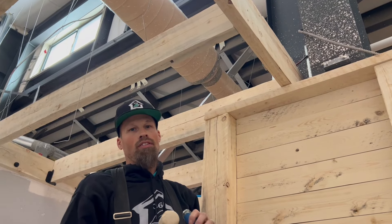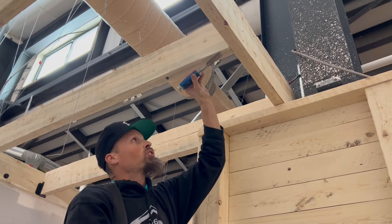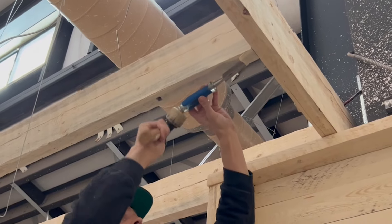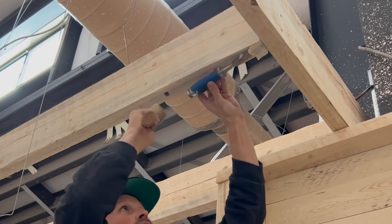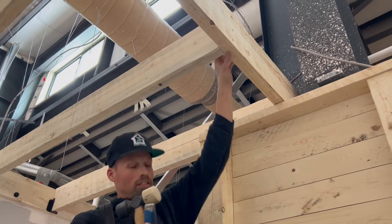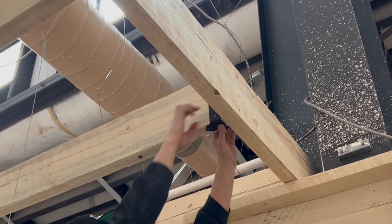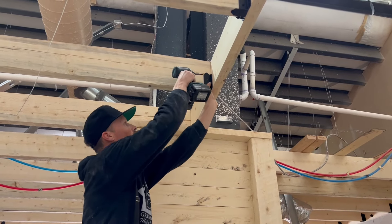When we're using rough cut lumber, not all the dimensions are exactly the same, so I am just going to chisel where the joist hanger is going to go just a tiny little bit, and that will help it seat just a little bit better. That's pretty good. I'll see how my joist hanger fits — and that sucks up a whole lot nicer. I always start one screw before I put the hanger on.